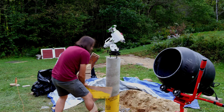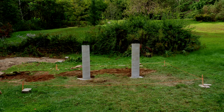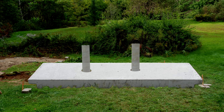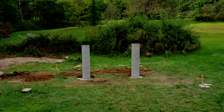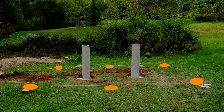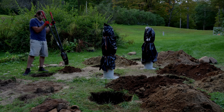After a few days, I ripped off the cardboard form, leaving the completed telescope piers. For the foundation, I had two options for my location: a concrete slab with a haunch foundation, or for the building to sit on several structural piers of concrete. I opted for the latter as it meant I could do all the work myself more cheaply and not have to hire contractors.